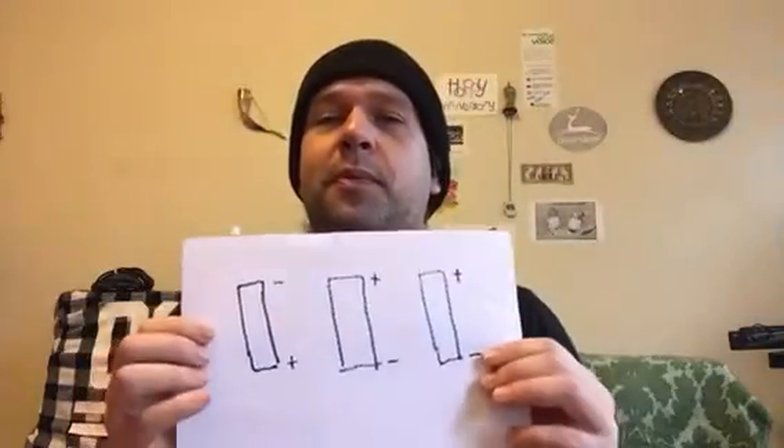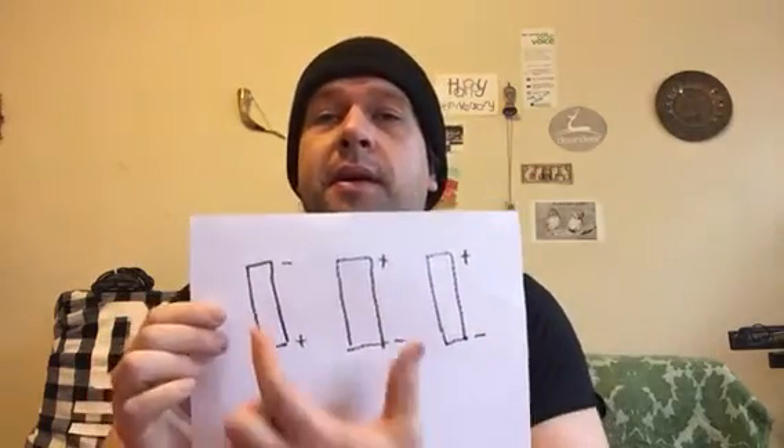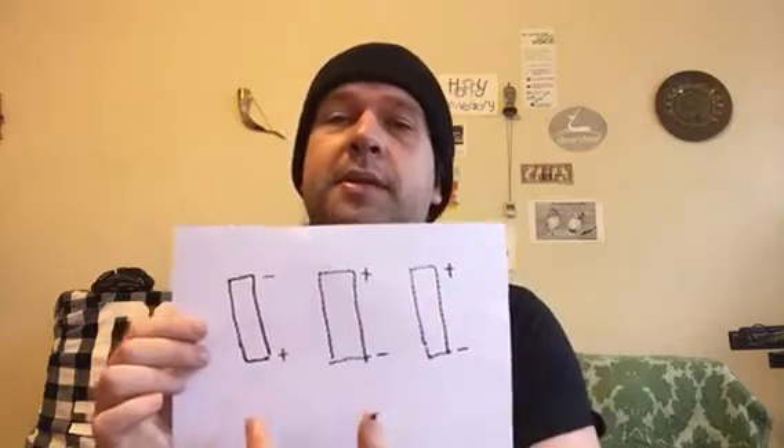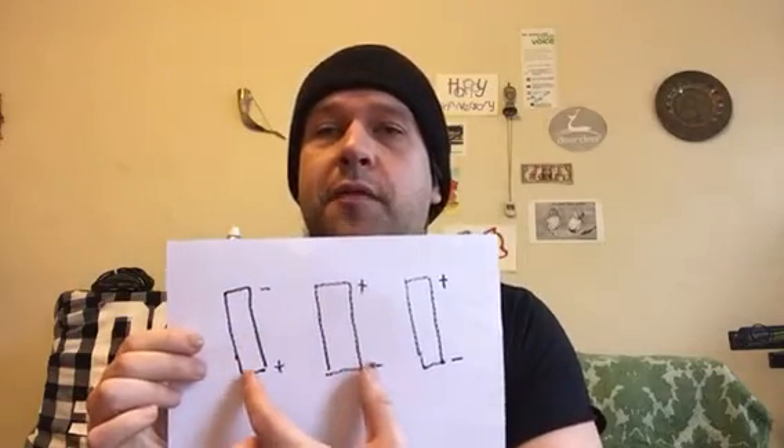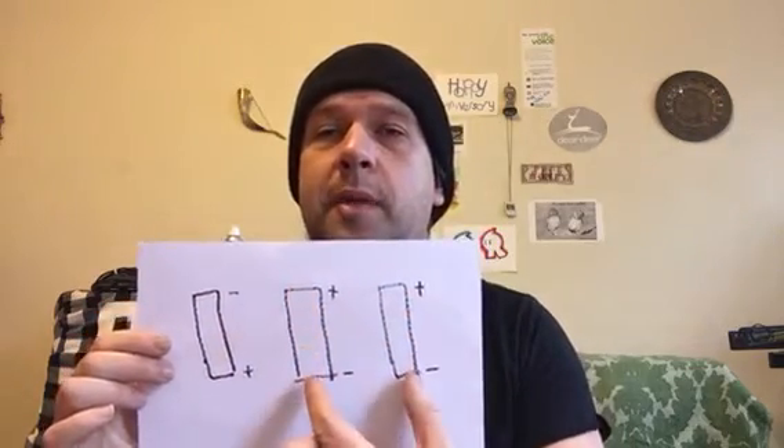This is the Brian May wiring. I don't care what Andrew Guyton builds, I don't care what Brian May's book says — surprisingly, I find it really difficult to understand why such a mistake would be printed — but this is Brian May's guitar: the pickup that has the magnet flipped and the coil reversed is the bridge one. Because as you just heard Brian May say, the bridge and the middle pickups in phase humbuck — minus plus, plus minus, they cancel each other out.